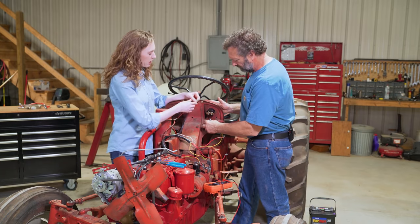The next wire is the other red wire, and that's the one that comes up to the alternator — we hooked that up earlier — and that goes on the negative side of the gauge. Pull the nut off, put your wire on, and tighten the nut back up. We like to use a nut driver to make sure they're tight. The kit includes a little jumper wire that has to be put in at the switch, jumping power from the positive to your terminal block.